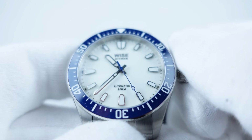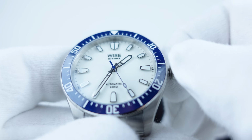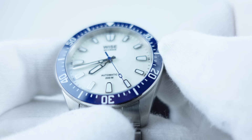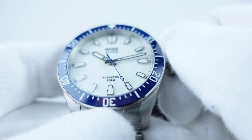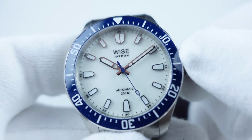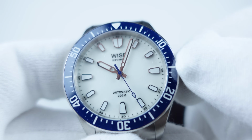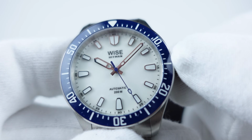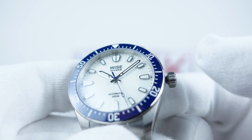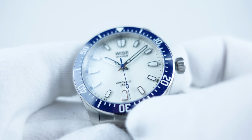In the time setting position, it feels smooth clockwise and anti-clockwise when you cycle through the 12 hours to set the time, light resistance to the gearing, minimal backplay to it. When you rotate the crown clockwise and anti-clockwise, there is some slight backplay, so you have to become accustomed to taking up the slack, but it's minimal and it's perfectly acceptable. Once you become accustomed to it, it's not detrimental. Pushing the crown back in, it's got a nice positive click and that restarts the movement.